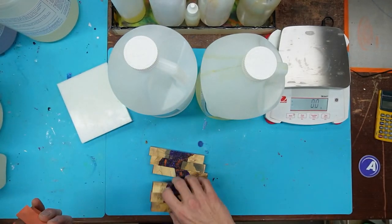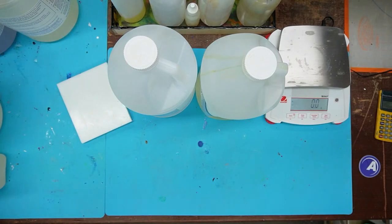The reason I didn't get these cut up already to show you guys was I blew a brake on my SawStop. I was cutting some of those honeycomb blanks for Carl, and it didn't happen for any of his blanks. It was this extra piece that I went back to trim up. I didn't think to turn the brake off, and it blew the brake. So I was out for about two weeks without a table saw. It was nuts. Then I ordered a new brake, put it in the table saw, and it went off also for no apparent reason, the first time that's happened to me with the SawStop. I think what might have happened was I didn't double check that the brake and the saw blade were the right distance apart. I finally got some new ones in and haven't had any issues. So now the table saw works again and we can get some work done.